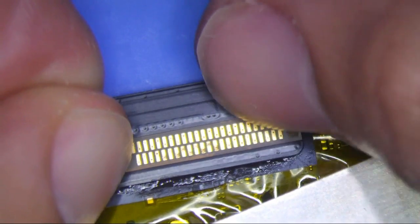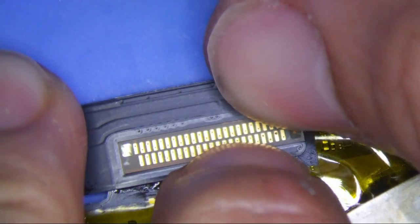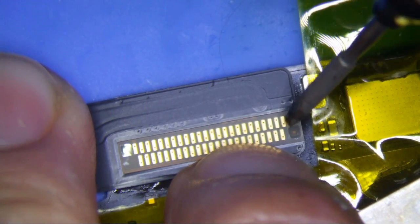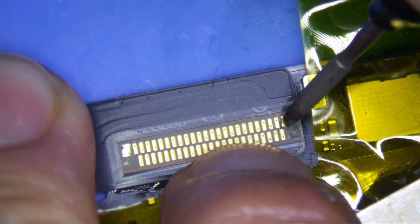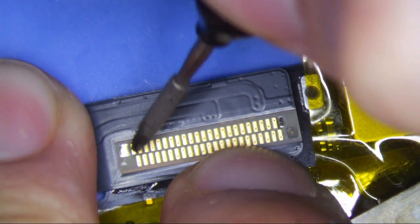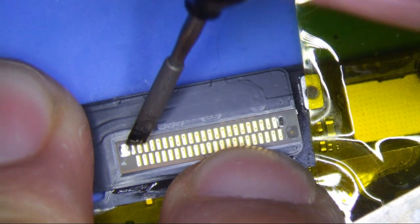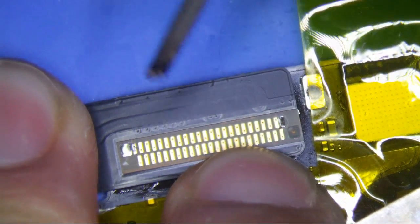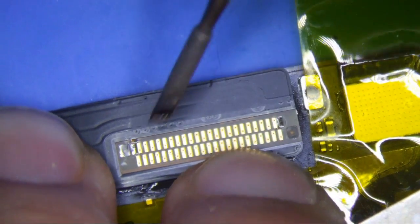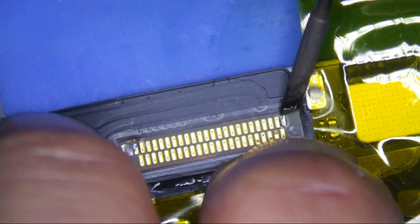There's a clear plastic on the ends of this connector. You want to make sure that you can see the square perfectly through the clear plastic — that's what aligns it, that's the only purpose of that clear plastic. So what I do is I just solder the ends of it to hold it in place. I need a little bit of flux here, and you really want to put some flux on the top as well so that you get a nice little solder joint.